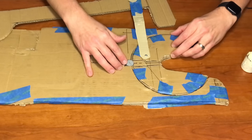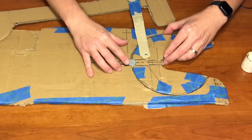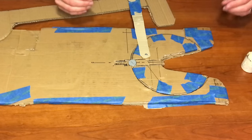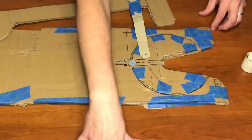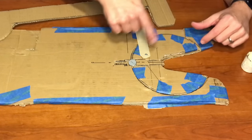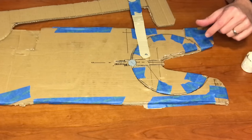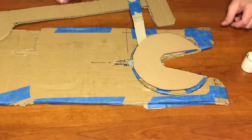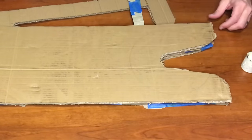And at that point in time, the ball bearing at the very beginning, this ball bearing, if I can get it, is pushed back into the center, and it's waiting there. Now, when the catch wagon comes down for the next cycle, that wheel that's riding on the cam suddenly falls off of that cam again, and the hammer starts to push back down on this guy. It tries to shut the jaw, but it can't because of that ball bearing. It's bound up on that ball bearing again. So at this point in time, the catch wagon's on its way down the lift hill. The jaw is sitting open, ready to accept the next train.